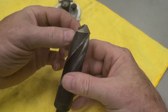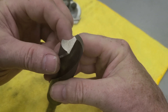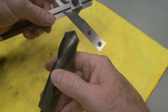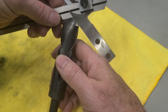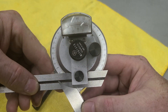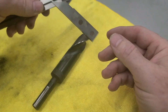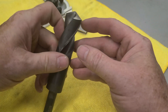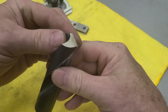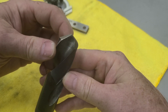Now, I said this thing didn't have the ability to adjust the point angle. Here's a bit that was sharpened on this machine not too long ago. If I look here, this is the point angle right there — it's about 60 degrees. That's kind of what you get. The most important thing for me is that this be even — I get both sides cutting at the same time — and this machine does a great job at that.